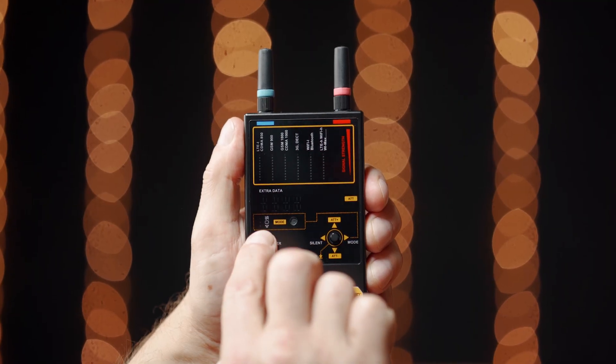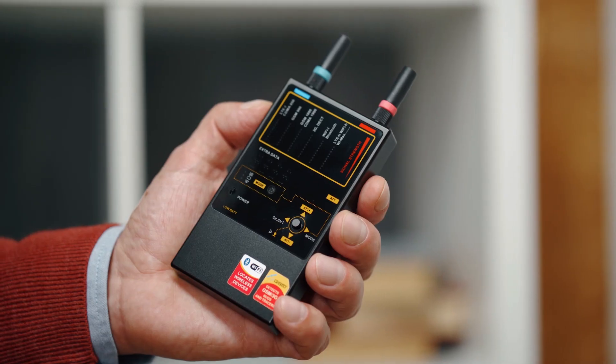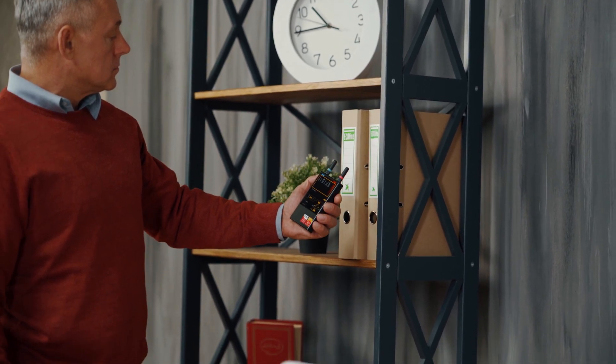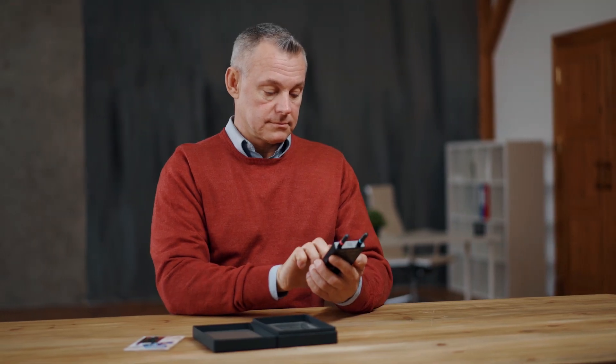Choose the desired operation mode. Silent is the default mode, which is automatically selected after turning the unit on. The listen mode is more convenient for locating and inspecting the RF source, as the operator can learn about the source by hearing a demodulated signal.